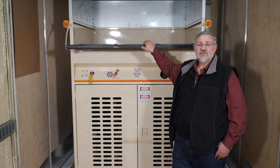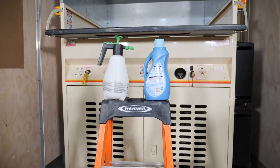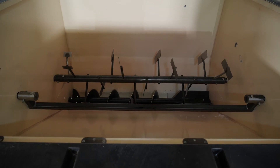To start, be aware of ambient conditions. A few minor adjustments up front can help you head off performance variances later on. If the humidity is less than 30%, add a half a cup of a 50-50 mixture of fabric softener and water to the material at the bottom of the hopper near the feeder.